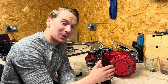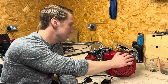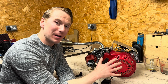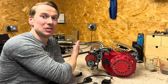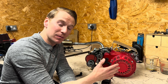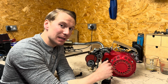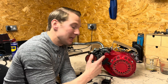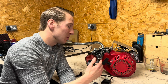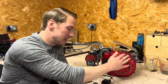Welcome back. If you've been following this channel, this is a GX160 or GX200 engine that has been converted to run on hydrogen gas. We have completely upgraded the engine — all the internals, valves, exhaust valves, the exhaust system, carburetor, and flywheel have all been updated and upgraded to run on hydrogen gas. The end application for this engine will be for a go-kart, so it's all about getting that power in there — I'm not too bothered about fuel efficiency in this application.